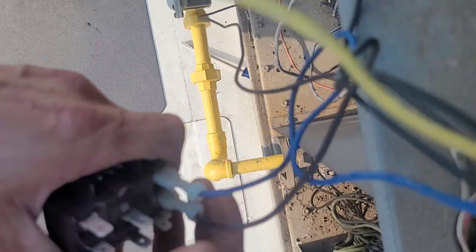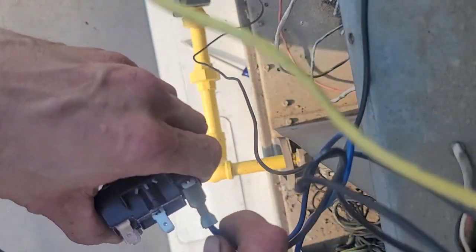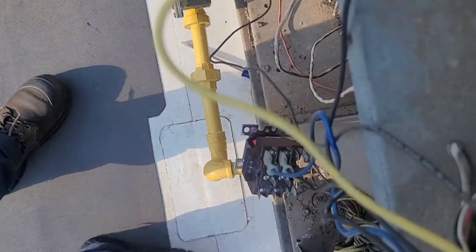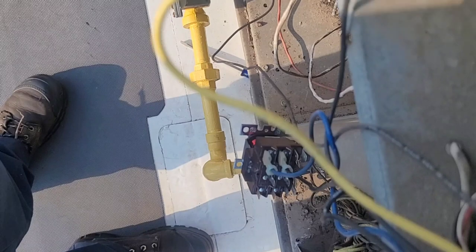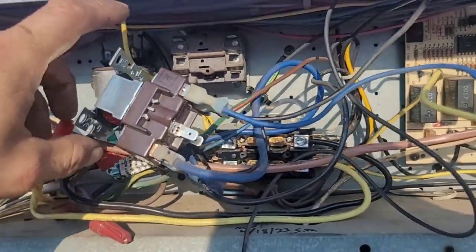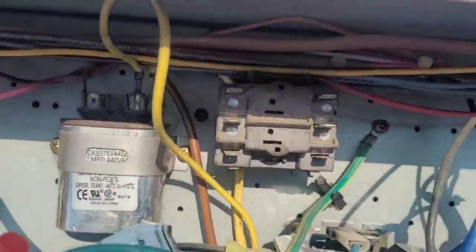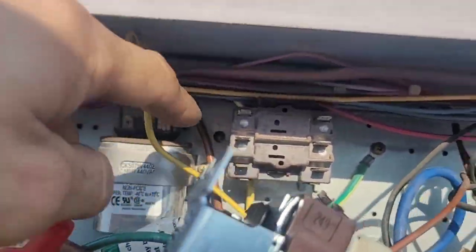There — that's better. Make sure your connections are tight, especially on high voltage stuff. The more current going through it, the more important it is to be tight. So when you go one wire at a time, you're left with something just dangling, and then your old one sitting there waiting to come out.